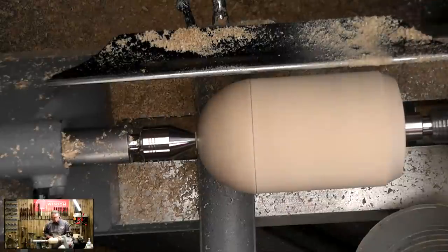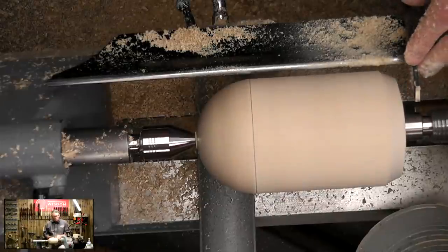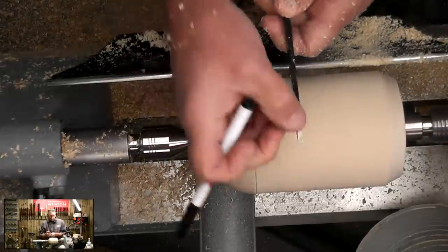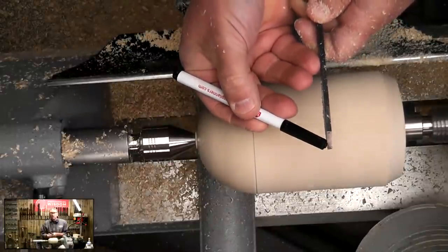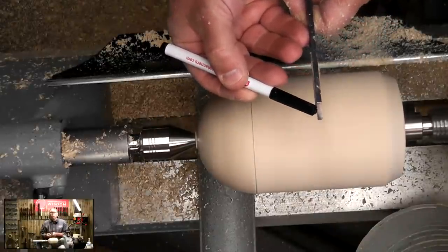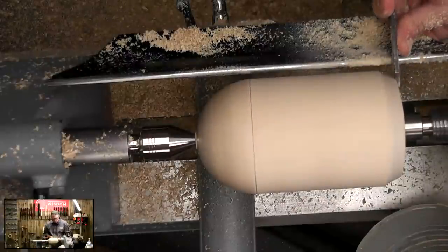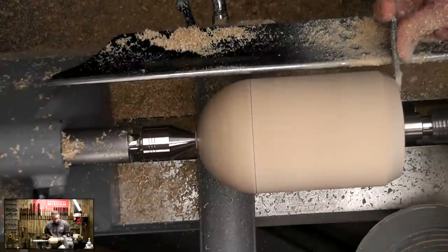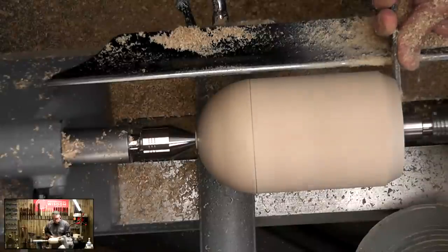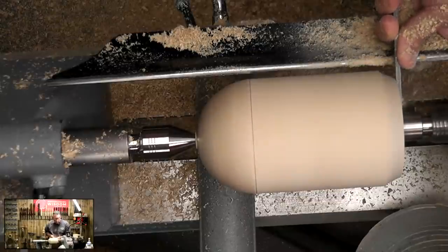And when you're using the parting tool, if you're cutting a long way, if you just cut down using the tip of the tool, you'll get quite a rough finish. So if you can put a little bit of pressure, I don't know whether I can show you this, a little bit of pressure on this surface here, the actual side of the parting tool, that will scrape as you're cutting down. And that'll leave you a much better finish than just using the tip of the tool. Using that side scrape.